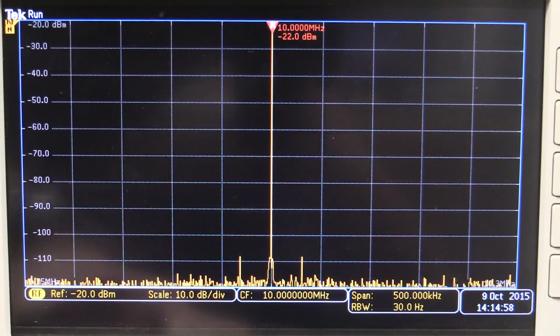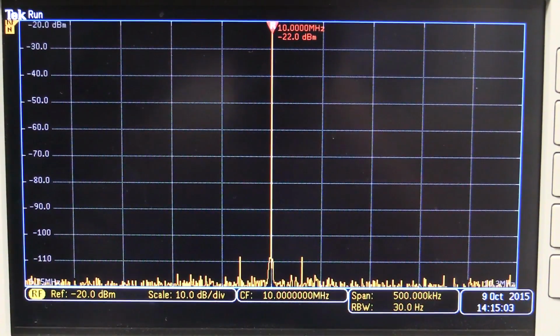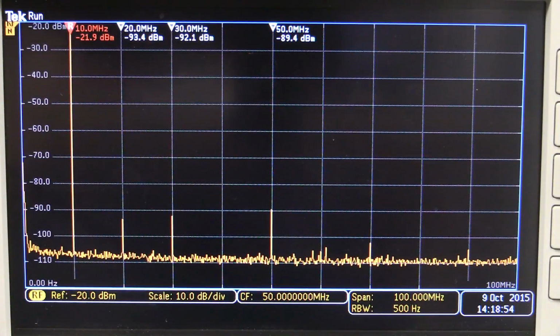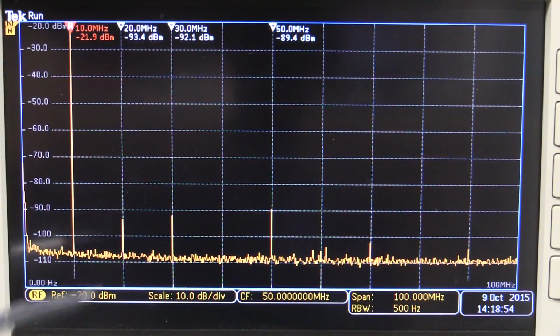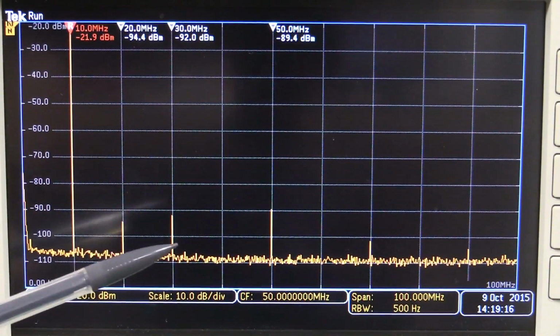And there's the output of the Rigol, and once again, it's not too far off the Siglent, but the Siglent X series is actually a cleaner output. Look, lower sidebands. And we'll just check the spurious performance of the Rigol here, the 4000 Rigol, and once again, we've got our 50 millivolt peak-to-peak carrier at 10 megahertz here. You can see some components.